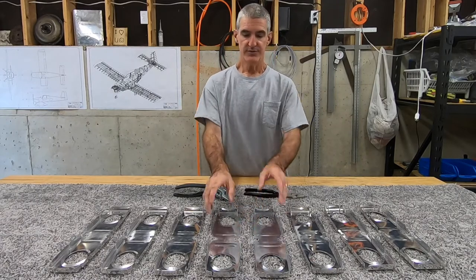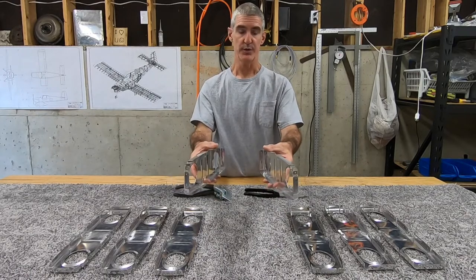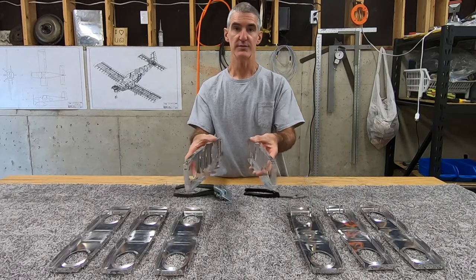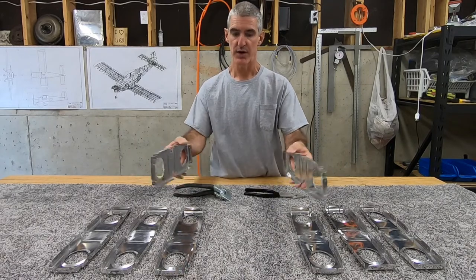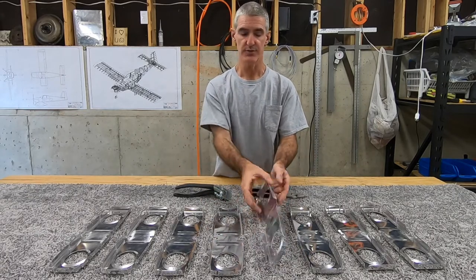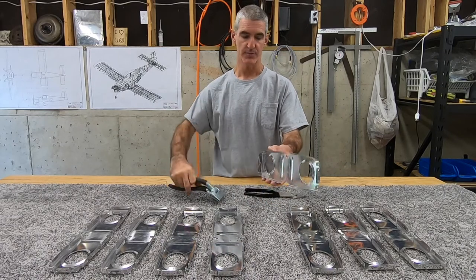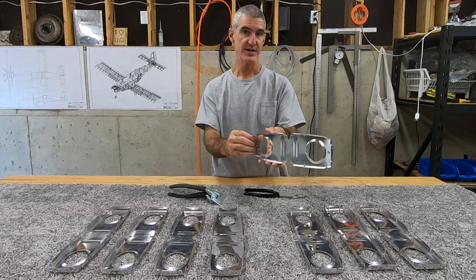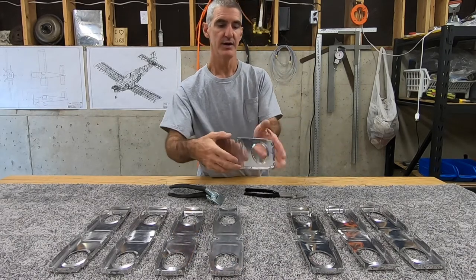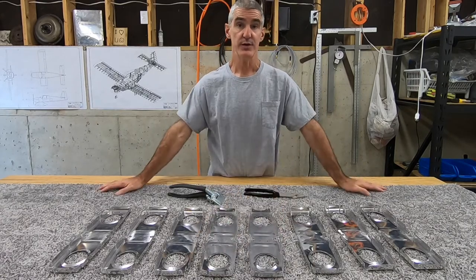The other thing I'm going to be doing is on these two most inboard of the in spar ribs — they are angled out slightly to follow the angle of the tail cone, so they're not parallel to the rest of the ribs and not perfectly perpendicular to the spars. I'll be using this hand seamer to bend the rear flange out by about nine degrees, and then I'll also be putting a bend in the web to bend that part back nine degrees the other way.